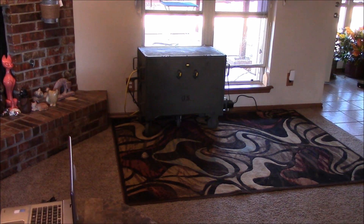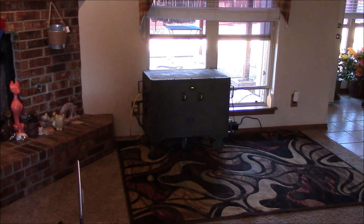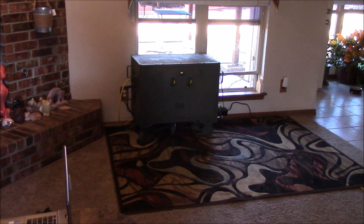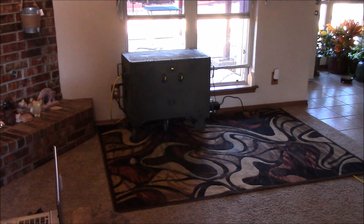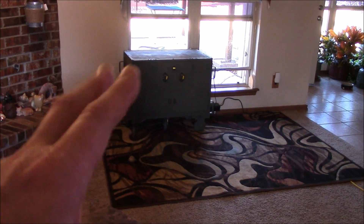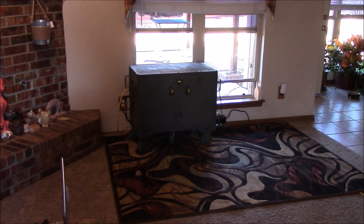That's one of the things to keep in mind with any off-grid DIY system: if you have 400 watts of panels and 400 watts continuous load, you can do it, but you're not going to charge your batteries. Right now with 270 watts continuous and panels making about 300 — about 75% of rated power, which isn't bad — you're not going to be charging very much. I can use up to 1500 watts, 2000-watt surge, so I can make coffee, run a refrigerator, all kinds of stuff, especially in short bursts. I just want to get this thing in use — alright, thanks for watching, we'll see you next time.